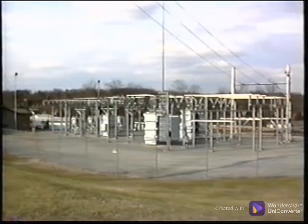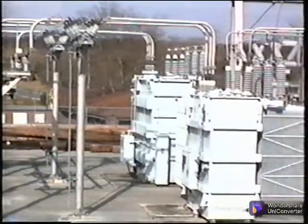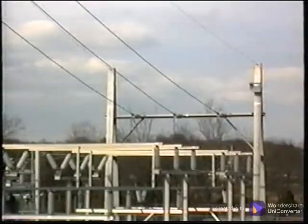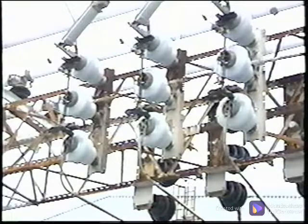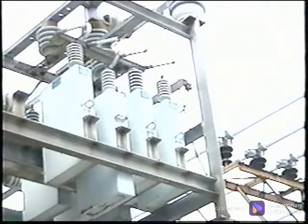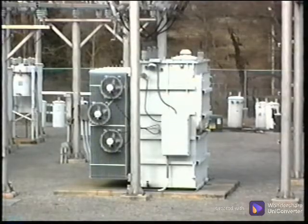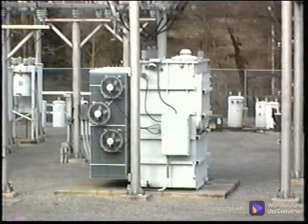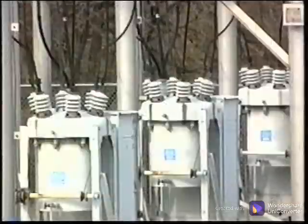Switch yards can be inspected from the ground, with the best result being achieved at night just after sundown. Hot spots are usually the focus, and the night cooling enhances this, making them much easier to locate. Components in a switch yard include switches, fused disconnects, transformers, capacitors, wire, bus or terminal bars, oil or gas circuit breakers, and reclosures. Remember that some hot spots may be naturally occurring in some equipment due to internally mounted strip heaters used to keep out moisture.